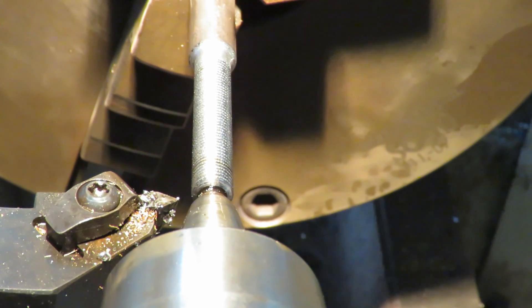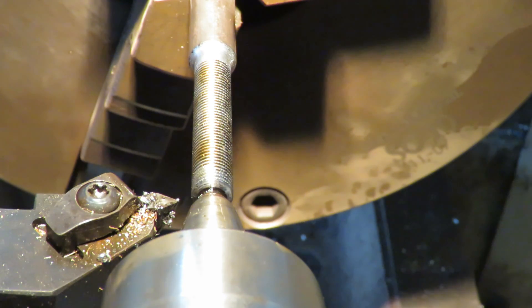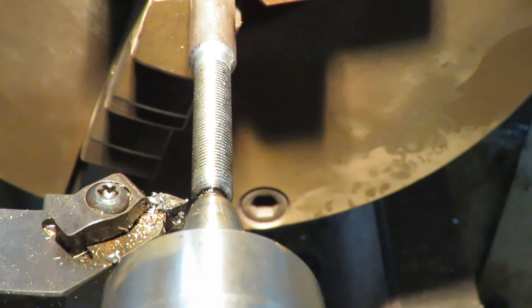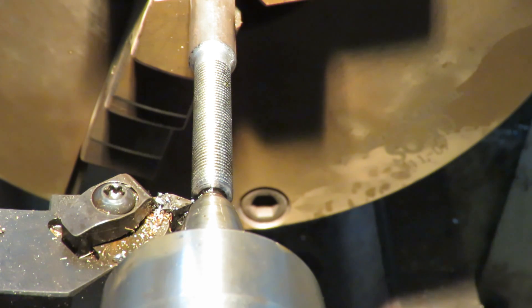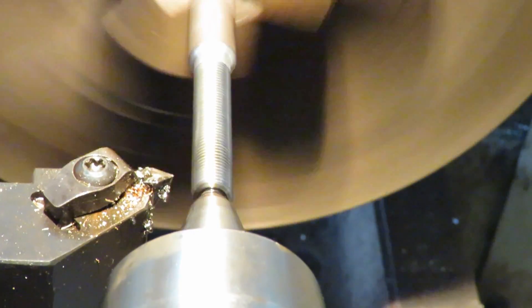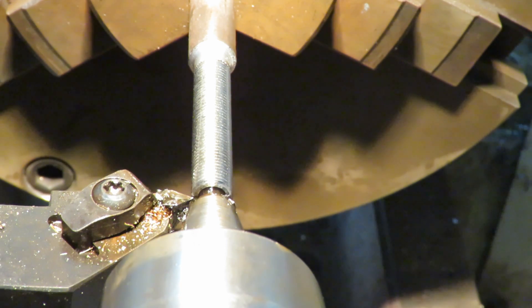I do have the advantage of having a foot brake here. We're using some of our black smelly, smoky cutting oil, which I love dearly. We're now going to go into one millimetre — cut the second cut. I'm going to come back and do a finishing cut. Back on the same dimension, one millimetre.